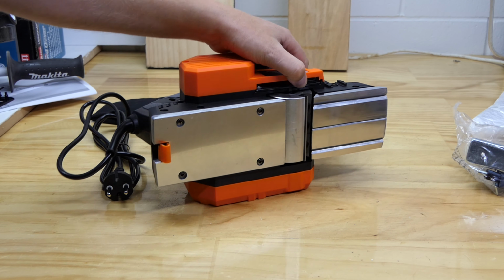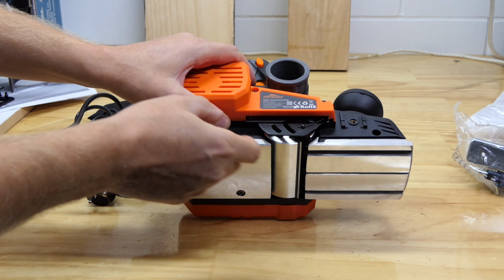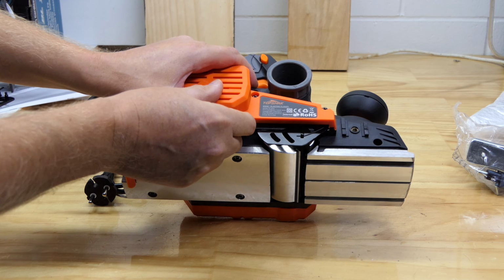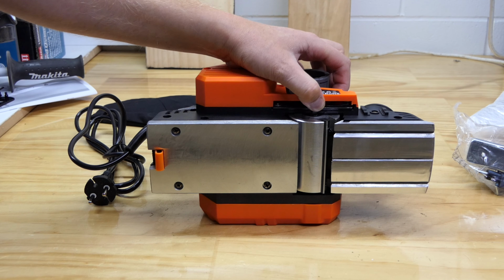the paint off weatherboards. If you take a look here, we have a massive rebate available here. But how deep can it go with this rebate, or as they call it, shiplapping feature? 24mm, that's what. So this will mean you can shave off paint from weatherboards and get right up to the weatherboard above the one you're doing.